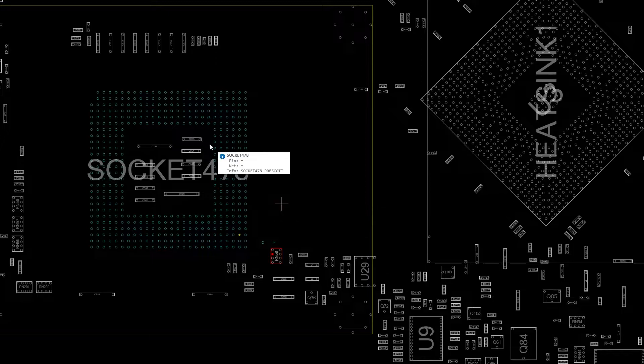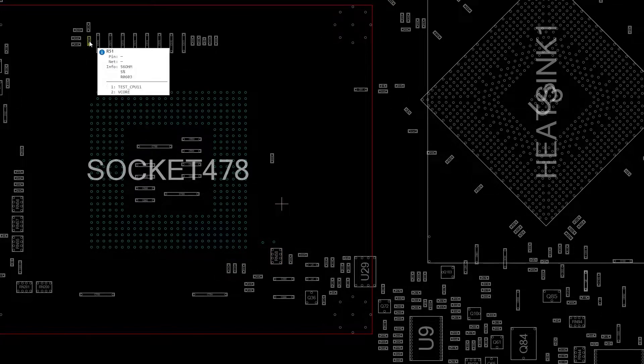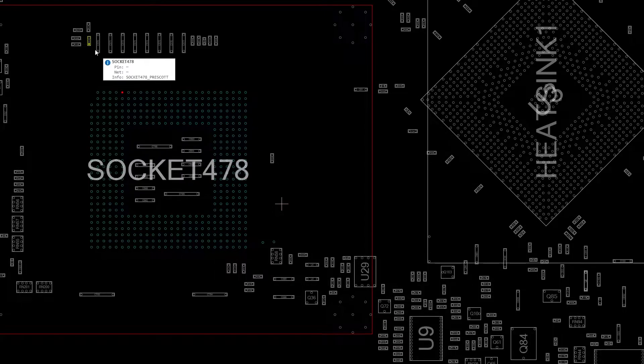I removed the trace and put it on the back because there is a test point there. Same for the deep sleep pin - it goes to a 56 ohm resistor as well. I removed the resistor, but I would recommend you just solder to this side with a dip switch to ground, so you can use the pull-up provided by the board.